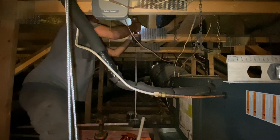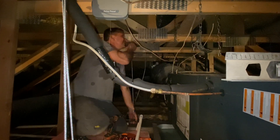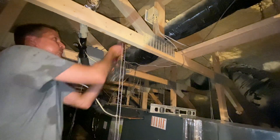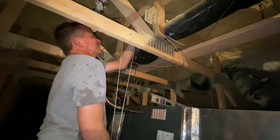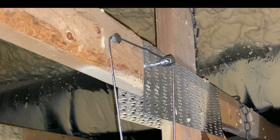Because my evaporative unit was held with cables that were crimped, I didn't want to cut those in any way. So I decided to add a couple of lag screws over on the bracing in the attic to raise each one of those cables up about an inch or two. I lifted up on that side of the evaporative unit and pulled the cable across that extra lag screw to lift it up. Once I guesstimated the first one, I measured how much I moved that lag screw up and matched that for the other three corners. After doing all four corners, I put my level back on top of the evaporative unit to make sure I matched what I had before. You can see the wire going through the center of the original anchor and the lag screw I added on the right-hand side — I did that at all four hanging locations.